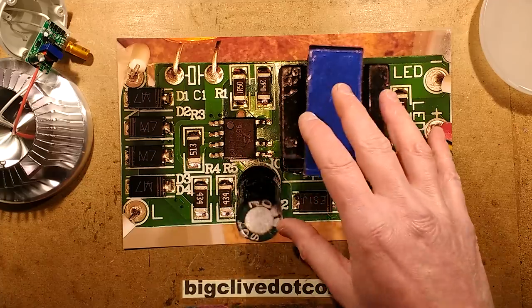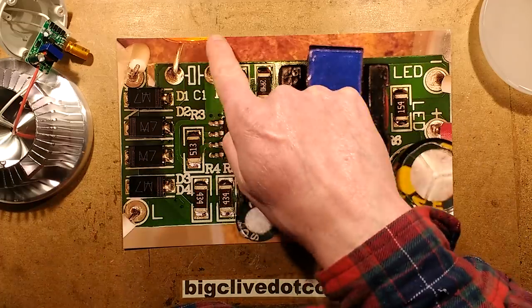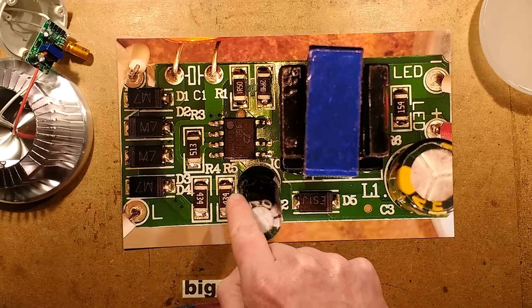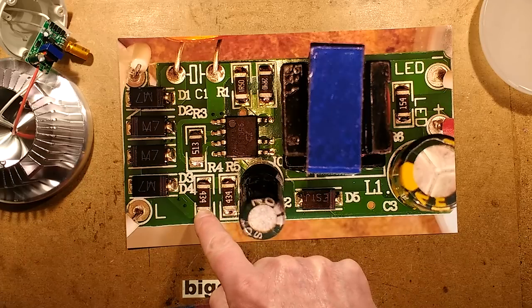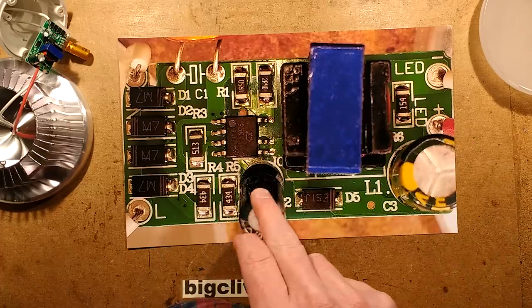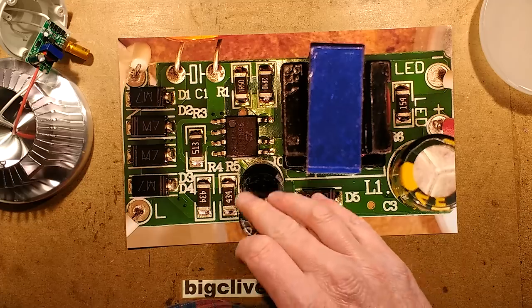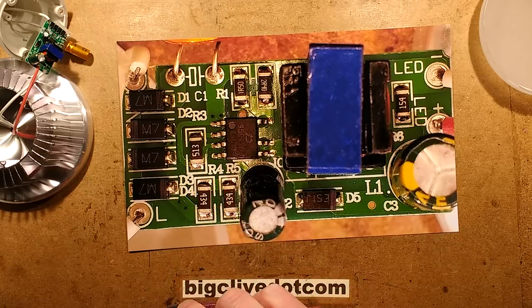When you try running something like this lamp on a 110 or 120 volt supply, you might think the capacitor charged to peak mains voltage could theoretically drive all those LEDs — no problem. But the main problem is actually down to these resistors. You could technically bridge one of these resistors out if you wanted to operate this on 120 volts, which would then provide the required current for operation. It may be that the only thing stopping it working on 120 volts is that the chip's own power supply has current-limiting resistors set for 240 volts — it's getting half the current it would require. So maybe just bridging one of these resistors would actually allow that circuit to operate.